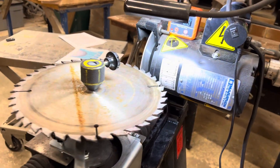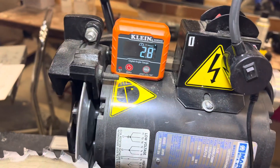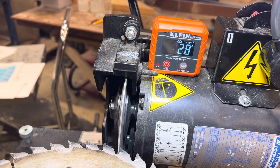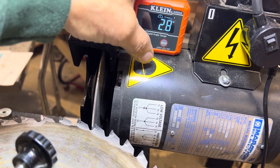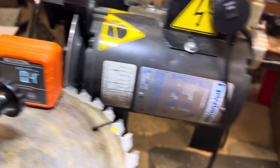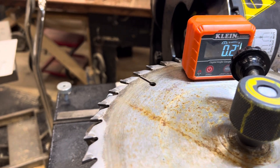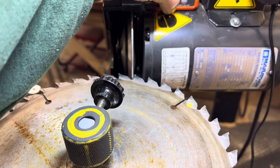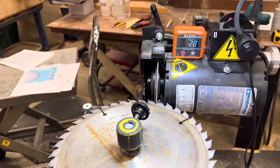Here's the machine — pretty straightforward. If you'll notice up here, I've got a light. I put an angle finder on the top of my machine. So right now you can see the angle is going down, minus 2.8. You're going to say I should be around 3. But sometimes you've got to be more clever than the machine. On one side here's where the motor is. Then you've got to say, what's my blade at? Now you're going to see over here I'm at about 0.2, might be 0.3. So when you take that together, you can say I'm at about 3.0, right where I want it to be — about 3 degrees.